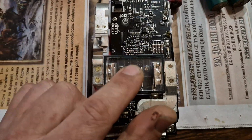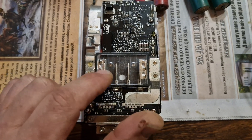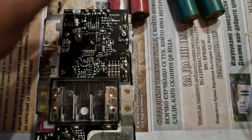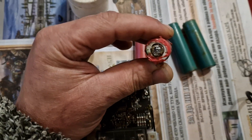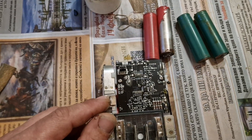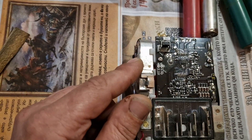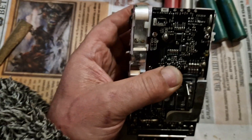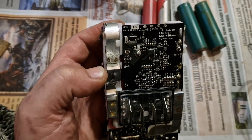I just fixed two of my batteries - these are AEG lithium-ion, but it works with any battery. These completely dead ones show zero volts, nothing. The new battery is 3.8 something and it can go up to 4 volts - these for example are 4 volts. Be careful when you solder.